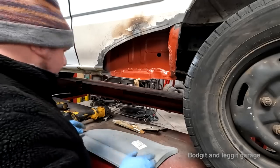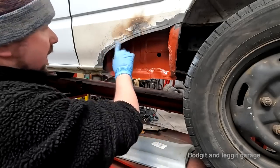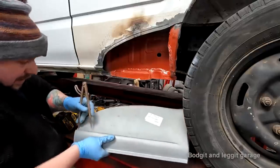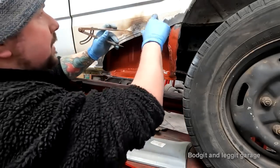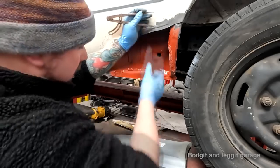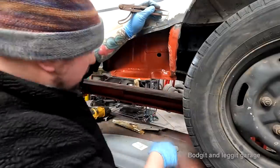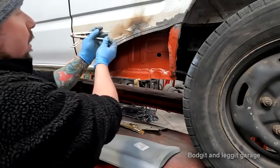Or what I can do is, this is another method I wanted to show you. So we know now that this is our original panel. So you want to get this panel down to this mark. We've got our scribes here, which are adjustable scribes. I can take marks, so from the bottom of here to this, like that. And then I can come down to our panel and I can mark that on our panel, like that. Then I can come to another point of reference, wherever that happens to be. So we'll say just kind of there on the point of that angle. Actually I haven't got that, so we'll have to go from here to there, for example. So that's on our mark, which is there, so we can then mark it there. And essentially go all the way around and get a mark, depending on where you want.